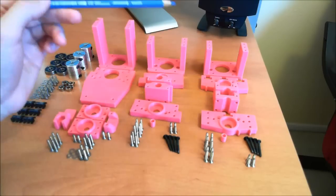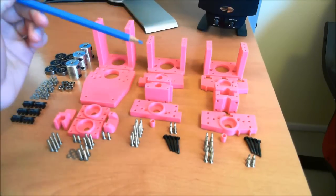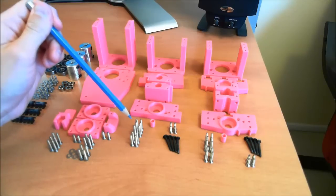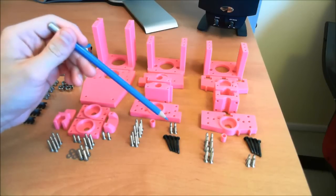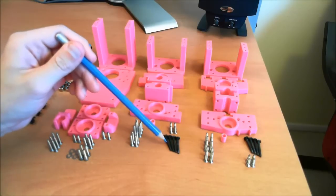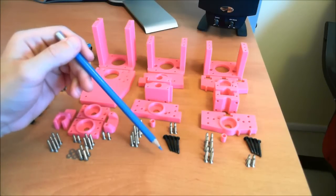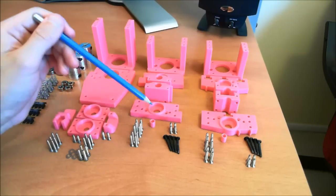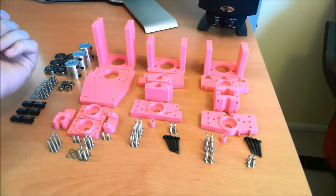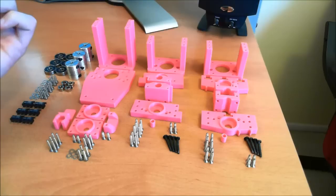You can see there are four holes here — this is just for my usage. The version that gets released will just have two holes, and I'll explain why later. These are number four, three-quarter inch self-tapping countersunk screws. These are half-inch number four self-tapping countersunk as well. These are probably one of the harder parts to find — M3 self-tapping button heads. I'm using 20 millimeters; you can be a little flexible. These basically hold the plates to the aluminum extrusions. The ones that come with the Proxon are a little too short, especially if we're trying to beef this up. As I get into the assembly, I'll explain why I've gone with this design and some of the problems it's trying to address to make the MF70 a little more suitable for CNC work.